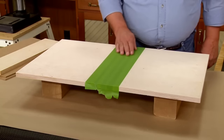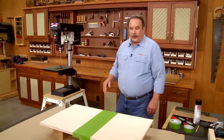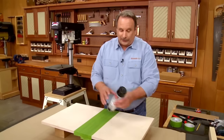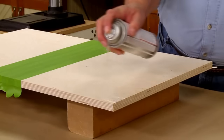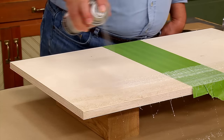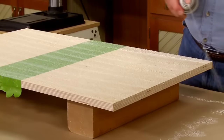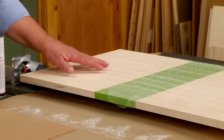All of the center section where the insert will go is now covered up. Now I can put contact cement over the entire surface of the plywood. In this case I'm using spray contact cement — it's the easiest stuff in the world to use. I start off the workpiece and spray right across, continuing down until I've got a layer of contact cement all over the plywood base.